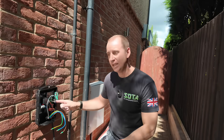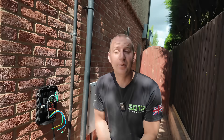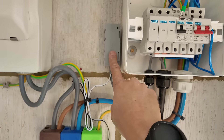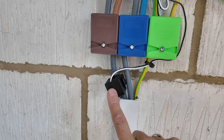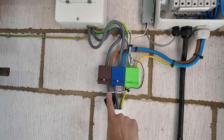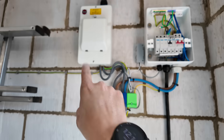CTs and CT connections — where do they go? Let's call this tip five. The Cat5 goes to a little plug — plug it in there, job done. The CT clamp — well I'll tell you where it doesn't go, and it doesn't go inside the consumer unit. You absolute lunatics who are doing that — let me show you where it goes. The Cat5 comes back out, joined up there, and then the CT goes on here on the line conductor, before any Henley or terminal block. That way this is measuring the entire installation and not just one part of it.